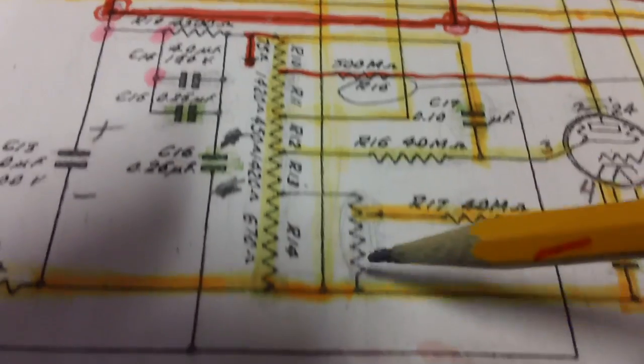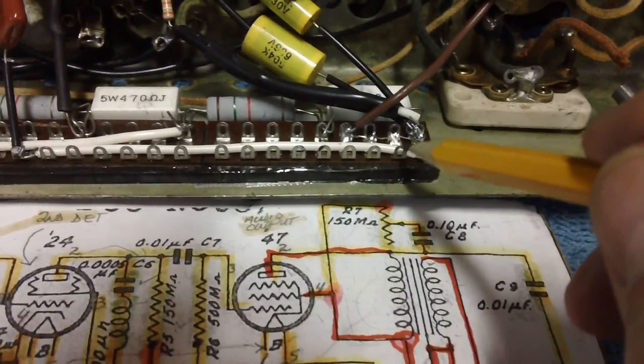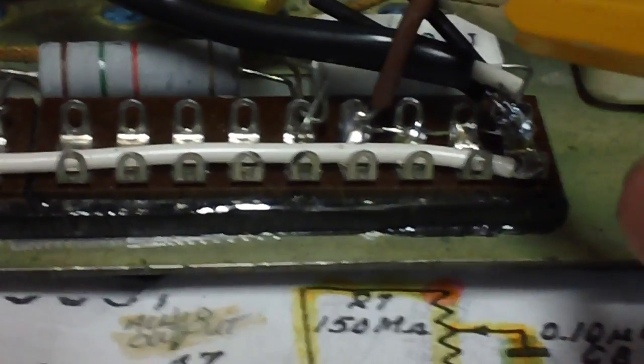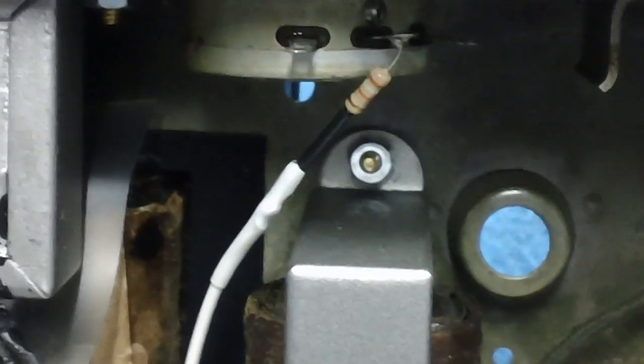We're going to have to run two wires all the way down here. The high side of the pot is going to go between the last two resistors on our resistor bank — between the 1420 and the 670. The low side will go to the very end over here. I strapped all these together with a jumper wire so I can connect another wire on there — sure enough, we are. So the low side will go here, and the high side between the 1420 and the 670.